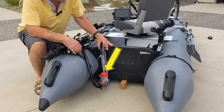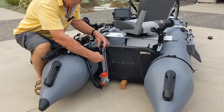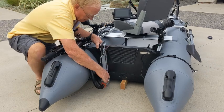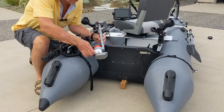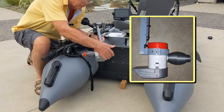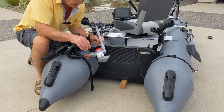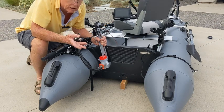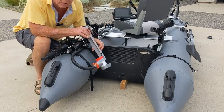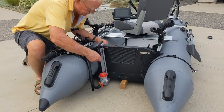Working our way around, this is the pump for the bait tank — rated at 350 gallons per hour. It works on a clamp mount that goes right on the transom, so it's really easy to take off. A really unique part of the design is this scoop — I replaced the bottom intake on these pumps with something I 3D print. It's got a shelf that fits up under the transom so that high-speed clean water comes into the pump and actually rams in, helping water flow to the bait tank. With any side-mounted pump you normally have to take it out of the water because the side arms aren't strong enough to hold it while moving, leaving your bait without fresh water. With this design, you just run it all the time.